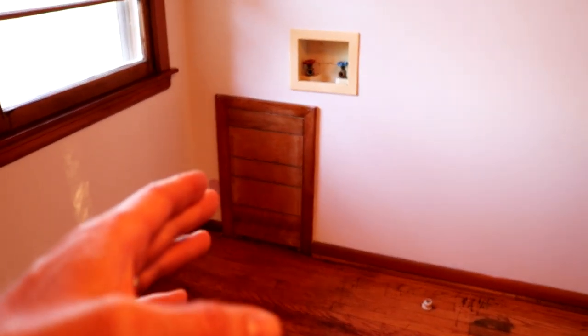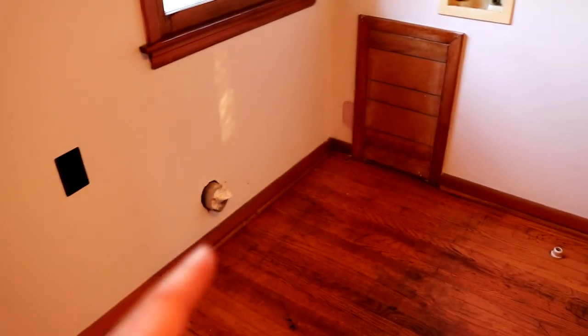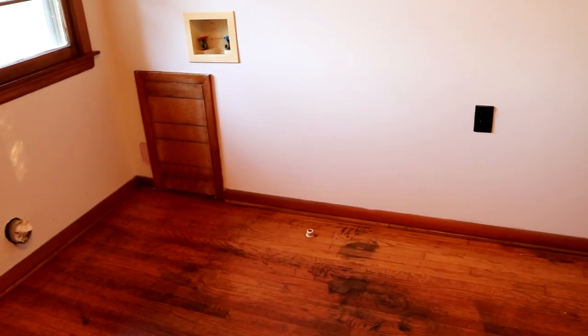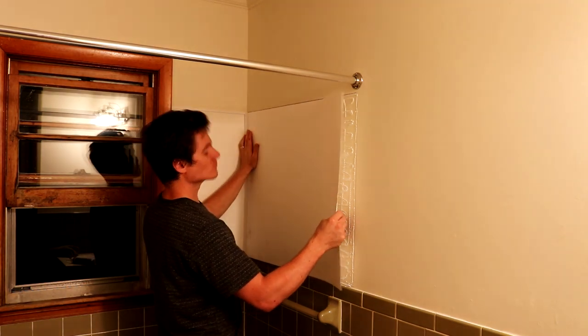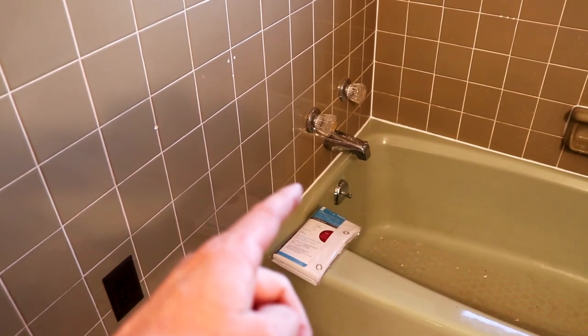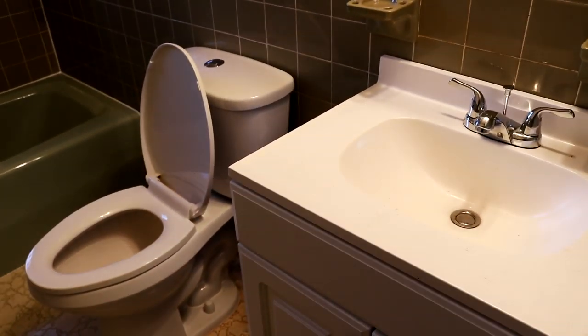That's access to the shower on the other side. On the wall you can see an outlet box for the washer, a drain for a drain pan, and the vent for the dryer. I moved the dryer wire down into the basement and will cap those off, since in the future I may want to set this back up as a laundry room. In the bathroom, pretty much everything stayed the same except for the shower — I added shower board, two curtain rods, chipped out all the old caulk which was rock hard with green coppery water stains, and siliconed everything back to a nice waterproof state.